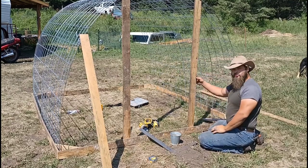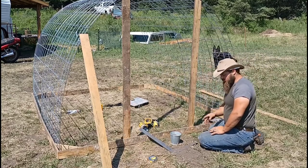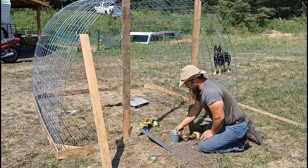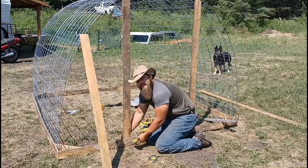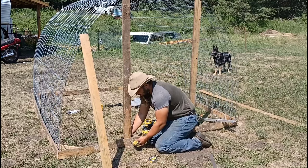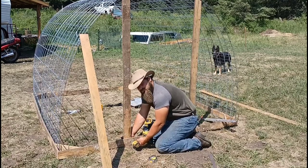Now those two screws will hold this relatively plumb up and down. And I'll show you how I will lock that all in a minute. So we're going to repeat that on this side. When it comes to doors, you really want to try and keep everything nice and plumb and square, and that's how you make a door function properly, open and close, and have longevity and strength.